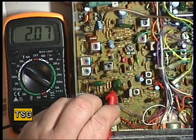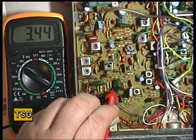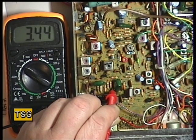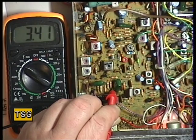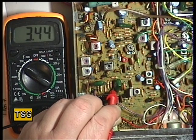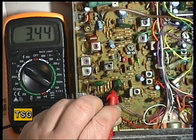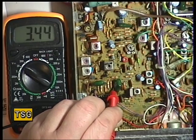So now we'll go to channel 40 and check where the lock is. It's supposed to be somewhere around about 4 volts on receive — it's 3.4, that's fine, we're in lock. And the same on transmit: 3.4, absolutely fine. So it's now properly in lock. As I've said many times before, the last thing you want is to send the radio back to the customer and find it only transmits from channel 37 or channel 40 upwards. You don't want channels dropping out.